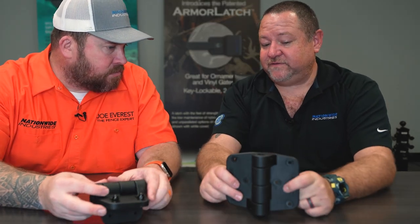What do we have here? This is an additional hinge in the heavy duty segment of Cornerstone 2. Right now we have a couple of ornamental heavy duty — they're much shorter flanges — and then we have the large 350F, which is the fully adjustable, similar to this. And then this is a non-adjustable. Now, the spring tension is still adjustable, but there's no horizontal or vertical adjustment. People wonder, why would you want that? Why wouldn't you want the fully adjustable? These are super easy to install. You put them up and just drive the screws in. While the fully adjustable ones aren't super difficult to install, you do have to mount a back plate first — mount the bracket first and then mount the hinge to the bracket. So it's a little bit more work to mount those.